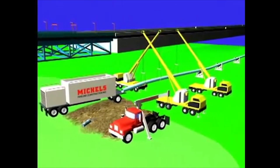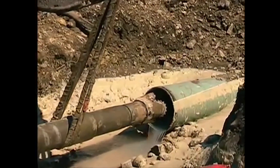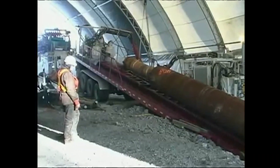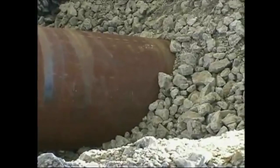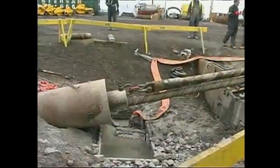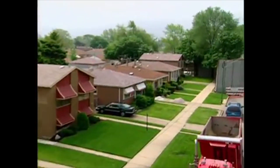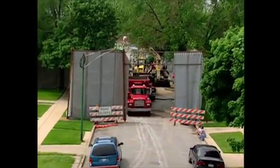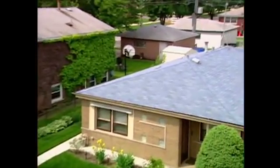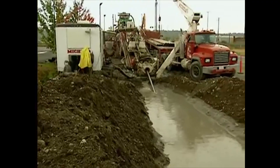Here's a typical setup for the rig side. Power for all of our equipment is completely self-contained. Sometimes, the HDD borehole is partially enclosed in a surface casing to stabilize overburdened soil and to protect the surrounding natural resources. The casing can also be used as a conduit for the utility line installation. We may also erect specially designed sound mitigation barriers around the work site when we're working in noise-sensitive areas. If space is limited, our typical setup can be safely modified to make the work area more compact.